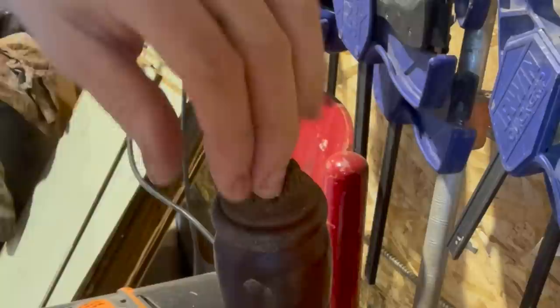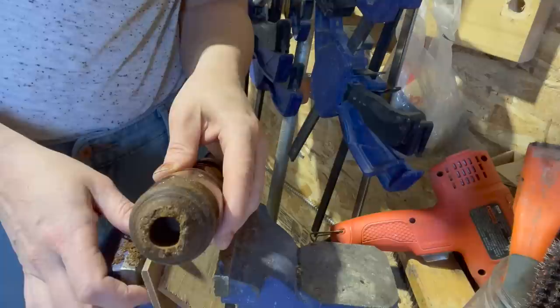Now that I've got a flat surface here, I'm going to use a Forstner bit. I'll knock out the sawdust — there's my hole. I'm going to insert my 5/8 dowel in here, but before I do that I want to position this on the chair, so let's take it over to the chair.